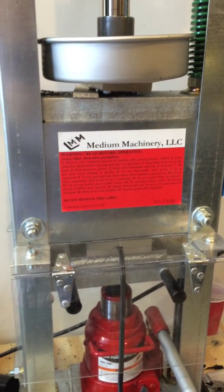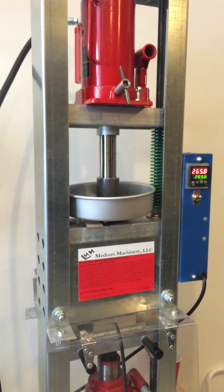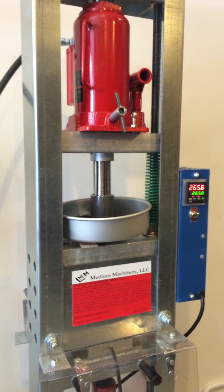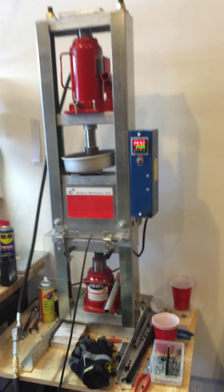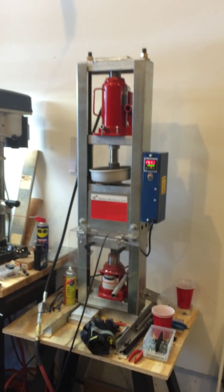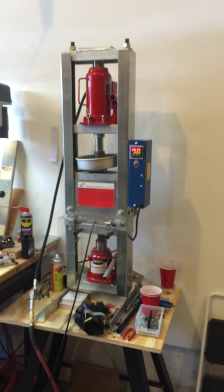We don't usually like to keep the mold in the heated area too long because the wire will actually get a little bit soft and when the shot goes in, it'll bend. So we're going to go ahead and get the shot going — you'll hear the compressor coming in as well. Usually about the time I hear the jack start to hit the pellets, that's about 10 seconds into the shot. I'll either count the compressions after that or sometimes I'll park in the center.